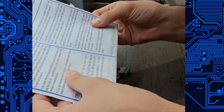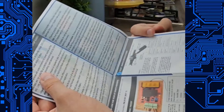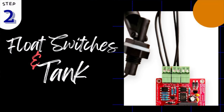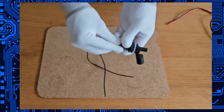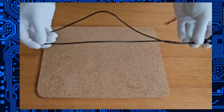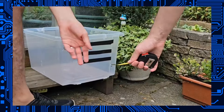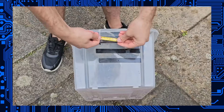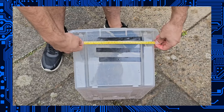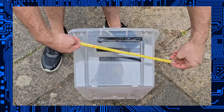At this point you should consult your user manual and familiarize yourself with the layout of the pins, and go through the basic safety recommendations. Step 2: float switch in tank. Now we're moving on to the float switch itself and its installation into the tank. One note: if you've already figured out where you're going to mount your circuit board enclosure, you'll need to work out how long the wires need to be to carry the signal from the switch to the circuit board.